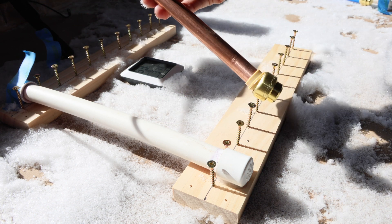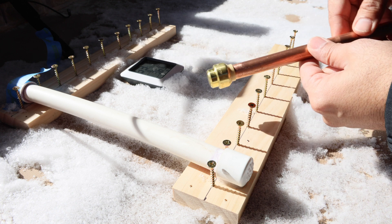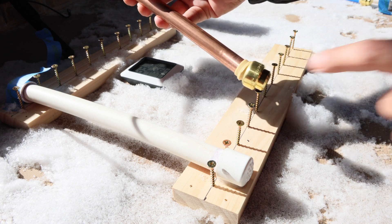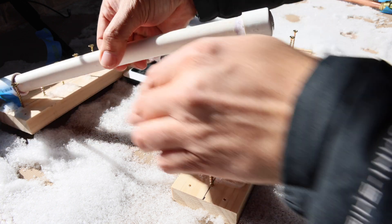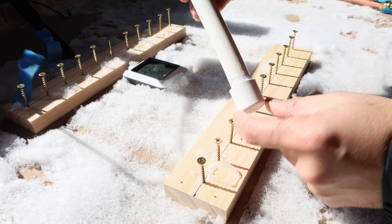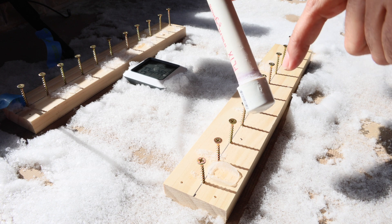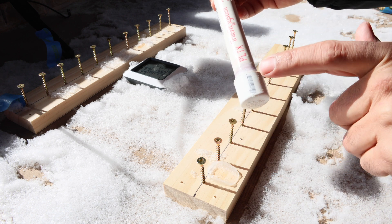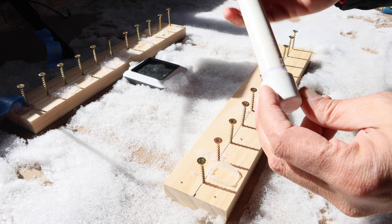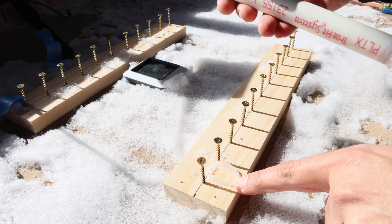And then this copper pipe — you can see it basically tore itself apart right here. So this is what happens if you did not drip your faucet — the force of that ice expanding is pretty powerful. And then the last one, the PVC pipe: on one end, no movement, but on the other end, the water expanded and just kept pushing and pushing and popped the cap off. Maybe I should have cemented it and let it cure overnight for a really solid connection. You can actually see the amount of water that leaked out.